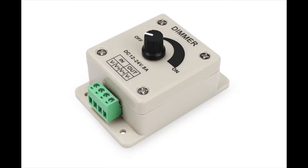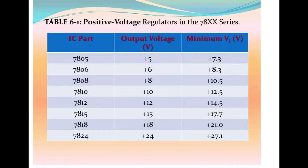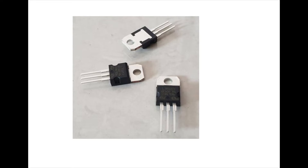That's why to protect this type of circuit we need a linear voltage regulator that can maintain a constant output voltage when the input voltage varies. There are many types of constant voltage regulator ICs like 7808, 7806, 7805, and 7812. On our experiment we need a constant 5 volts, so we are using the 7805 IC.